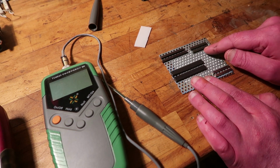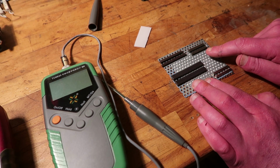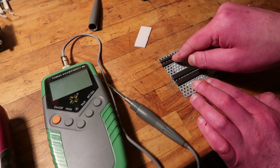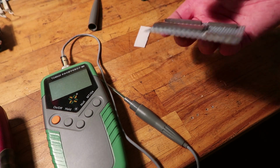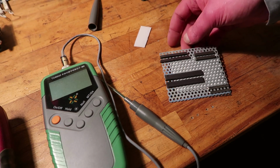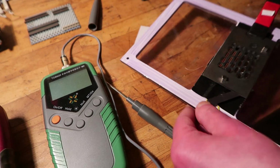I use this size of magnet in one of my tweeters in my planar magnetic panel. So the comparison of this to that will be the most fair. It's nice that you can measure this, but I wanted to see what it actually did on a panel in dBs. Now normally if the field doubles you should gain 6 dB. I made a weird construction.